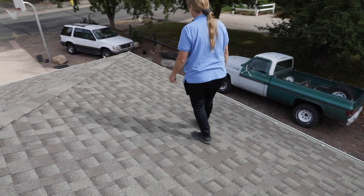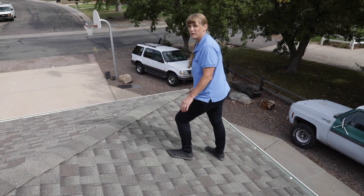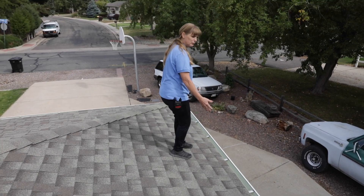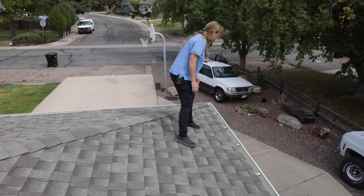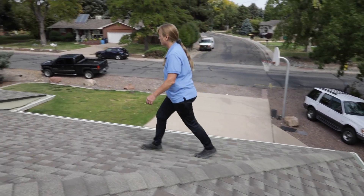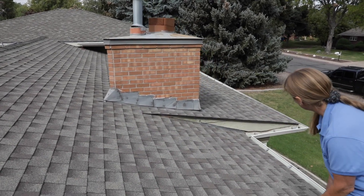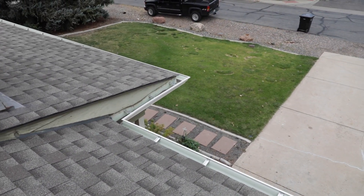We're going to look at the gutters over here. When you come down to the edge, you only go as far as you're comfortable with, and always go sideways or front-facing when you're looking at a roof, because typically you'll fall back. If you feel uncomfortable getting that close, don't do it. These look pretty good — gutters look good. Here's our flashing now we can see, and the siding is higher up, so that's good. I wanted to see that on the other side — I'll recommend they raise that and make repairs as needed.